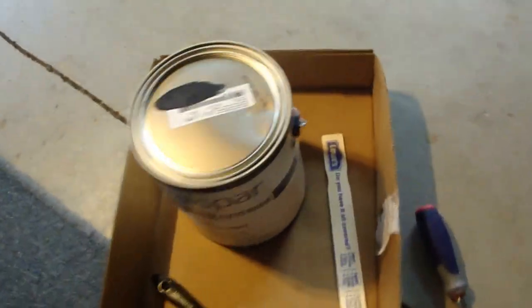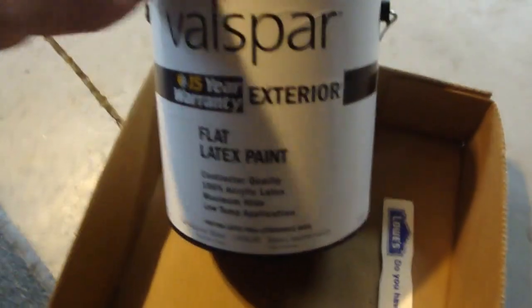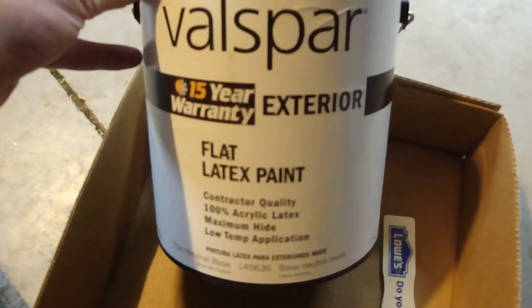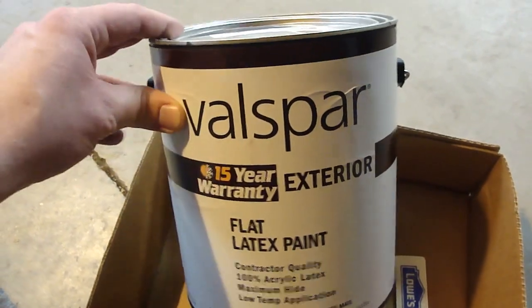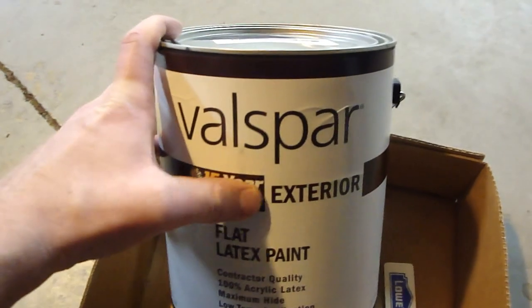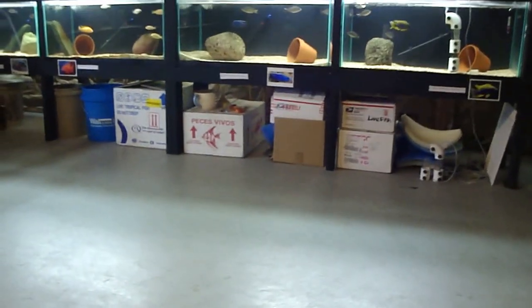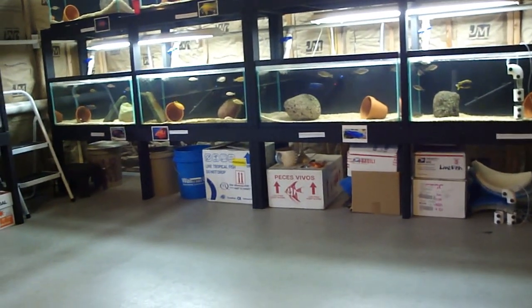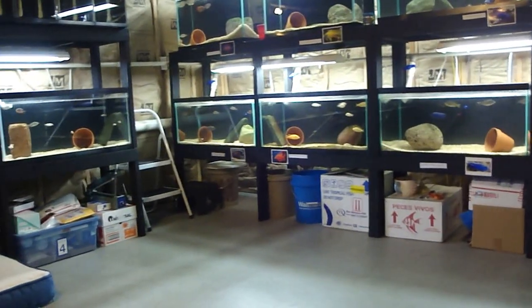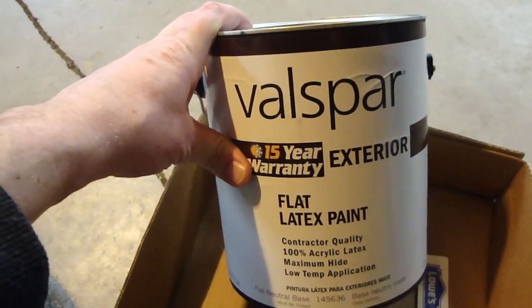You could paint it any color you wanted — I just chose black, but you can do blue, purple, pink, whatever you want. Flat latex exterior paint — it doesn't have to be this brand. I go up to my local hardware store; you can get any brand. Just make sure it's exterior so it's waterproof, so if any drips of water get on it, it won't wash off. It's also really good for the wood stands since tanks make humidity and water spray. I just buy regular lumber and when I paint it with this exterior paint, it makes the wood waterproof.